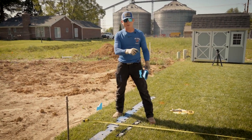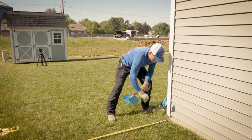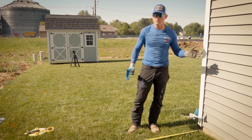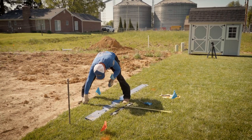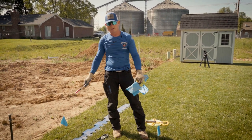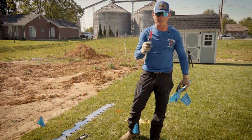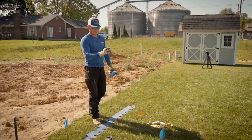The gate is four foot plus a two-inch opening and the panel is six foot one, so that's ten foot three. They don't have any small dogs, so we'll end up with about a three-inch gap between the house and the post. The pickets are three and a half inches apart, so that'll be acceptable. Centering at six foot one — four foot two — the gate goes on the flattest part of the slope. Walking straight through the gate we're not going around the air conditioner, which lines up perfectly.